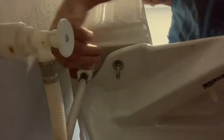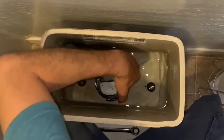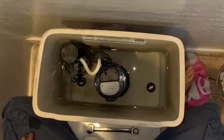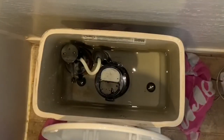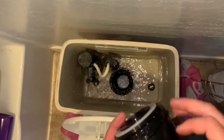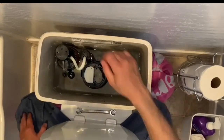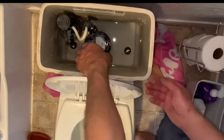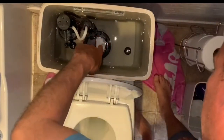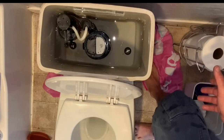Then I put my water supply line back on and tightened that down by hand. I turned the water supply on by pushing the valve back in on the wall and checked to make sure I didn't have any leaks around the bottom of the tank while it was filling up — I did not have any leaks. If you do, slowly tighten those bolts down one at a time making sure they're staying pretty even. If it seems like it's getting too tight and it's not sealing, maybe the seal on the bottom of the flush valve got dislodged, and you might need to remove the tank to check. Then I just played with the adjustment on the half and full flush valves. Depending on the brand you can also use those reference lines you made before as a guide, then just flush and make sure it's working good.